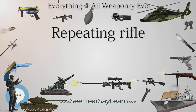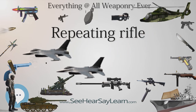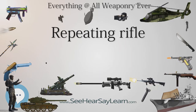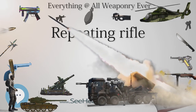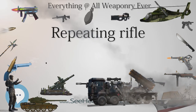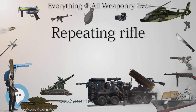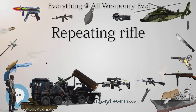Blowback: In blowback operation, the bolt is not actually locked at the moment of firing. To prevent violent recoil, in most firearms using this mechanism the opening of the bolt is delayed in some way. In many small arms, the round is fired while the bolt is still traveling forward, and the bolt does not open until this forward momentum is overcome. Other methods involve delaying the opening until two rollers have been forced back into recesses in the receiver. Simple blowback action is simple and inexpensive to manufacture, but is limited in the power it can handle, so it is seen on small caliber weapons such as machine pistols and submachine guns.